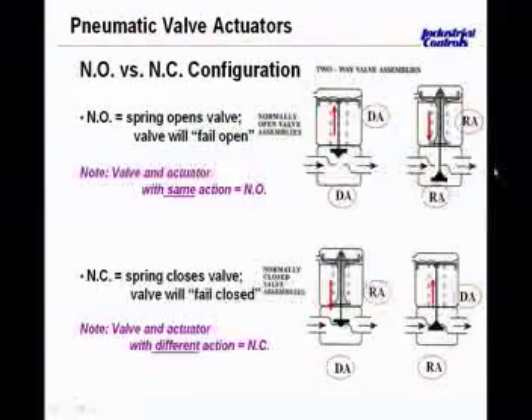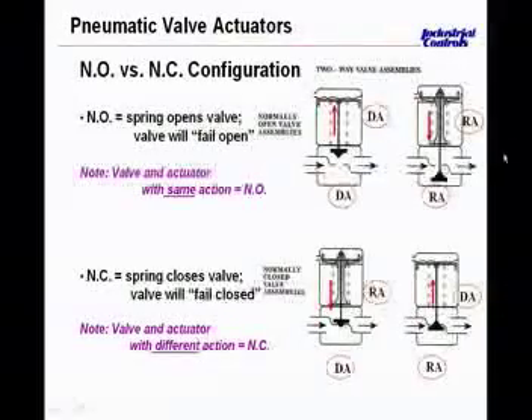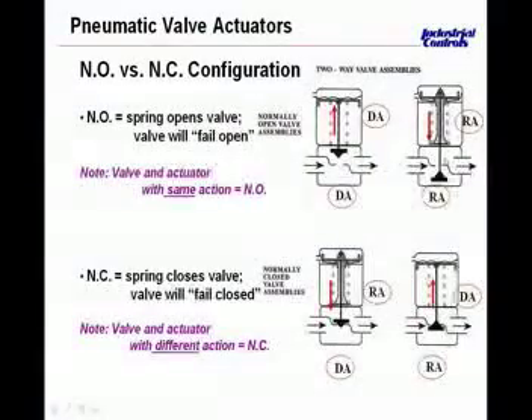John had pointed out that the plug direction relative to water flow shown here is not really accurate. Generally, the arrow on the side of any valve body points along with the flow, and if there's ever a doubt, the water should be going against the plug. So in this picture, the arrow should be flipped — flow would enter from the right, go toward the left, down against the plug, and out the left. If installed backwards, as the plug approaches the seat it will slam, the valve will hammer, and you'll lose your ability for smooth modulating control.